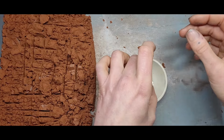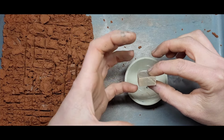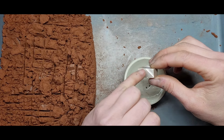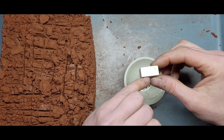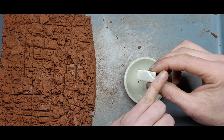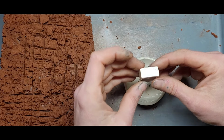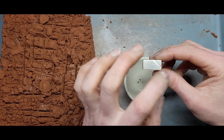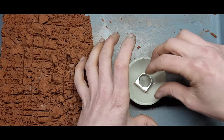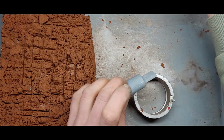Alrighty, so let's try sand casting a signet ring with cast in place stones that look like channel set stones. So to do this, I've got the signet ring here that I've cut a channel in, and it kind of says Terence on it because that's what used to be engraved in it, but I filed it right back until there's pretty much nothing left, so I don't think that'll show up. And to cast this so that I have this whole face to work with, I'm going to use Craig Dabler's core casting system. So you can buy that from his website, DIY Casting.